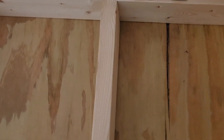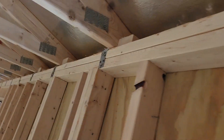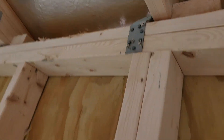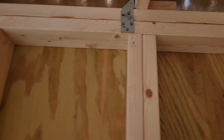Now let's talk about the roof trusses and how they're attached. You'll notice we use metal hurricane clips to attach our roof trusses to the tops of the walls. Other companies may not use metal hurricane clips or metal hurricane screws. We offer 150 mile-per-hour wind gust certifications on our buildings, and part of the reason we're able to do that is because we use these super strong metal hurricane clips.